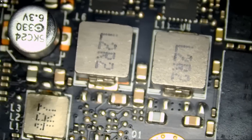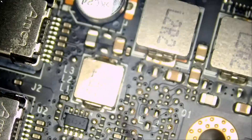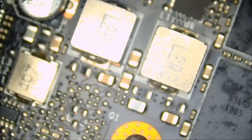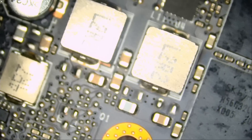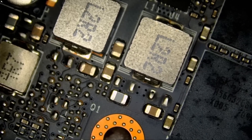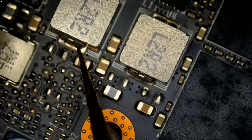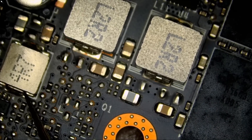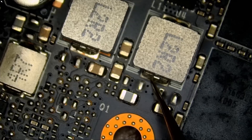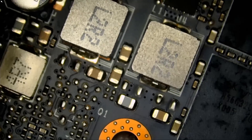We may have to turn off the power supply and back on because the voltage may appear for only a few seconds. Is this a bulging inductor on the bottom? Probably not. So let me turn the power supply off, put the lights down, and now turn it back on and quickly measure. We have 5 volts here and zero here, and 1.8 here. We're not going to get 1.8 if we do not have 5 volts.